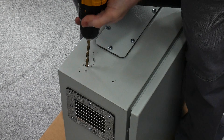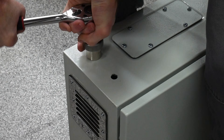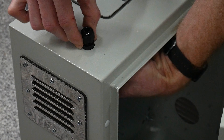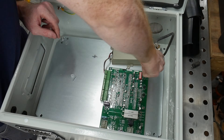At the very bottom of the box I drilled two holes for the motor cable and the solar panel cable. Both holes accept cable glands to aid in the enclosure's waterproofing. The original box just had these cables coming through an open hole with no seal, and that was the location where bugs entered my old box.